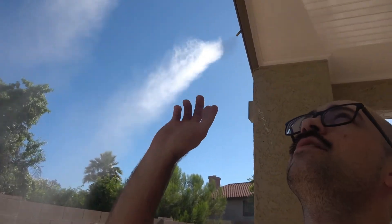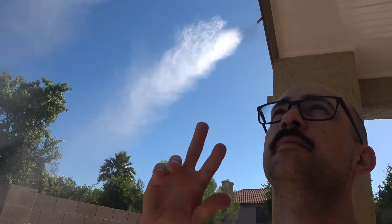The main way to control the amount of water you have coming out is the nozzle size, but it's also how many heads you have. You can space these out different lengths — common is like two and four feet. If you have a really big space and want a lot more water, go with two-foot spacing. If you want less coming out, go with four-foot spacing. The other big thing — much more expensive to achieve — is the water pressure.